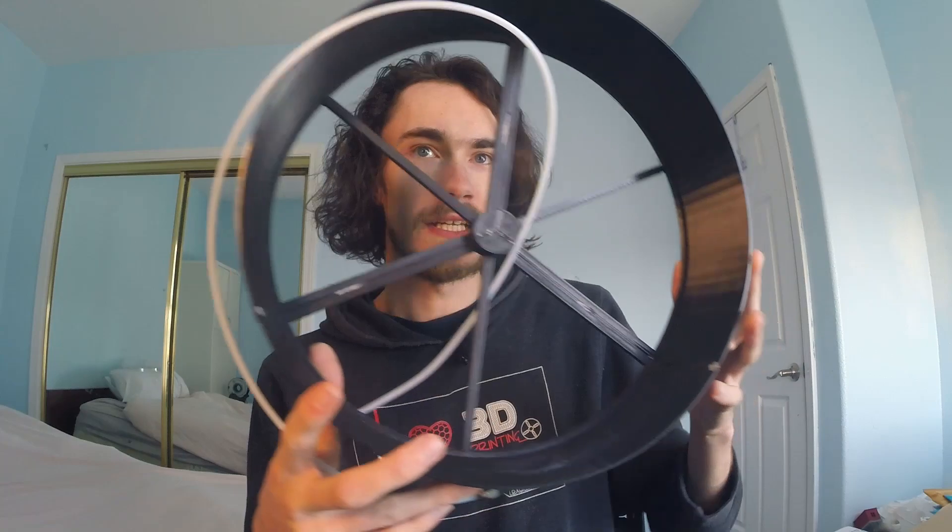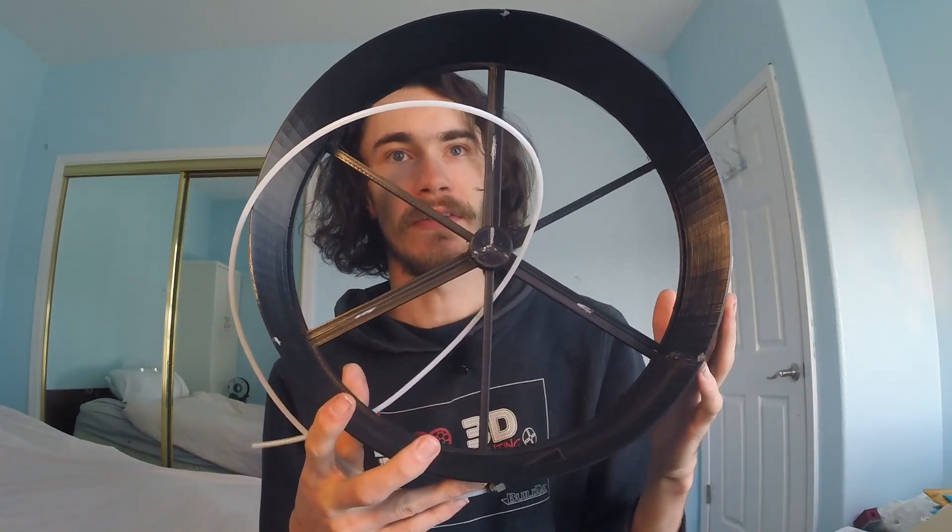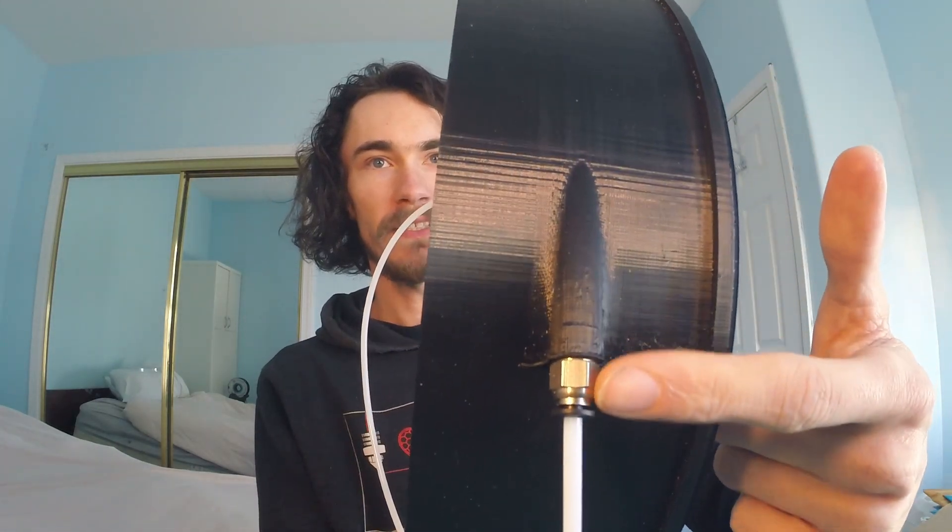Building this was relatively simple — it's three separate pieces glued together, with those square locators in the center. On one side there's a PTC fitting with a piece of PTFE tubing inserted. The advantage is I can run the filament straight to the extruder. On my Artillery printer, I can insert the PTFE straight into the extruder lever so filament feeds right into the printer without snagging. On my Hictop IDEX, I run the filament tube over the top of the machine and it rests on the extruder — friction from the filament keeps it in place.